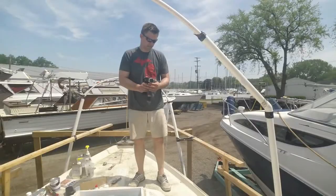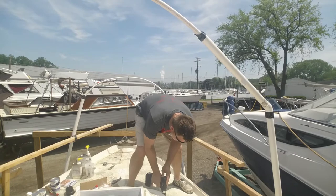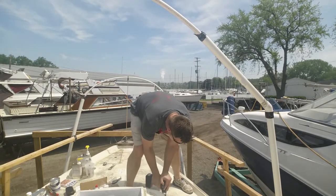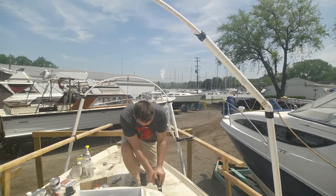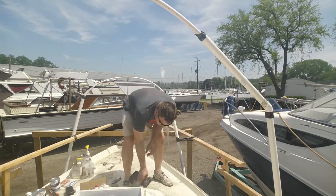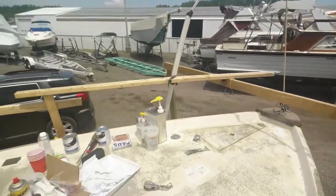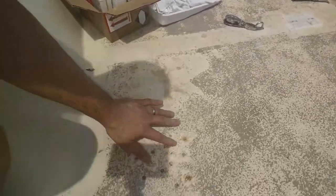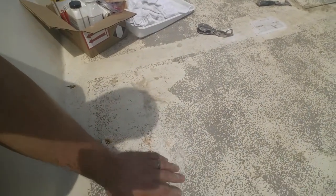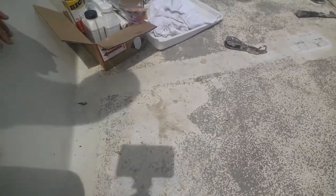Time to test the theory. Okay, the holes have been drilled. What I have coming out of here is encouraging - it's dry, and none of this is wet whatsoever. I'm going to vacuum this out and inject some epoxy into there, drop a cinder block on it, and move on to something else I can do right now.